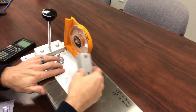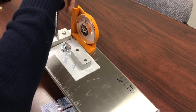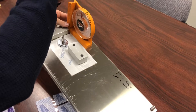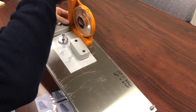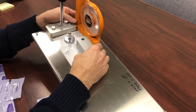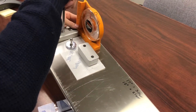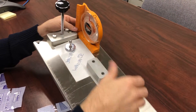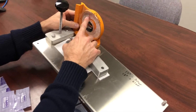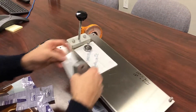This is roughly 11 degrees. As you'll see, it doesn't slide. You can pick this up slowly until you get to your degree mark and your breakover point where it starts freely sliding again. You take the tangent of whatever that happens to be and that will give you your static coefficient of friction.